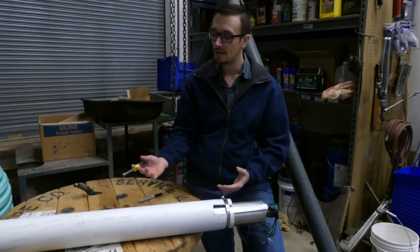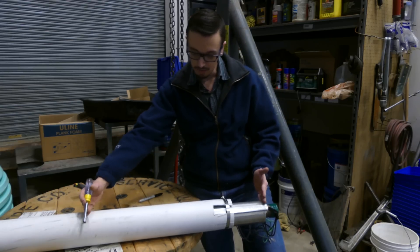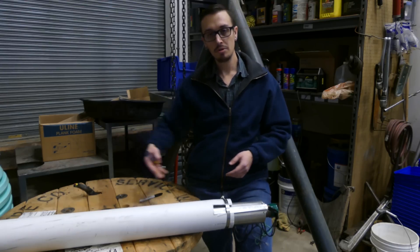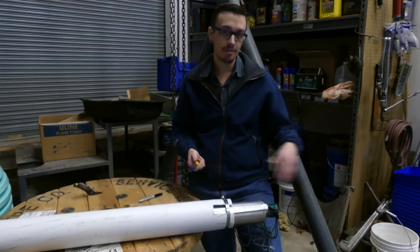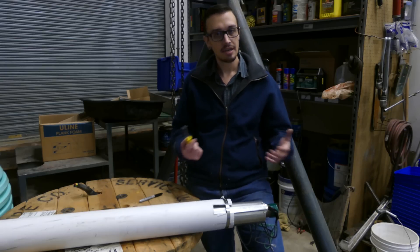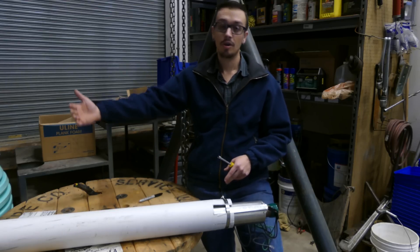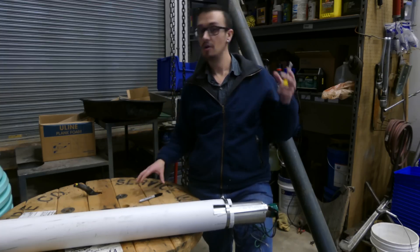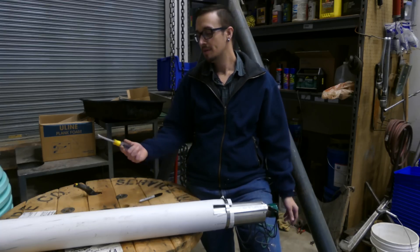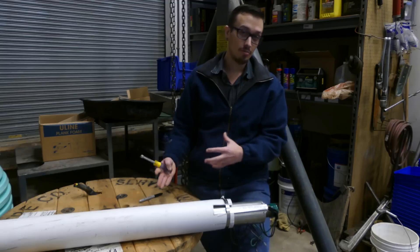You might have noticed the piece of pipe started out as a four-foot stick. The pump and motor is probably about two to two and a half feet long. We don't necessarily need all of that extra sleeve, so in most situations we would just hack that off and discard it. But there are some benefits to having the longer sleeve — if you've got sediment or sand in your well, it can help prevent the pump from drawing that sand up, since it has to work harder to pull it through. If you've got clean water and you're running the pump closer to the bottom, maybe you don't want that extra bit. As long as it's covering the motor, you're accomplishing what this is set out to do.